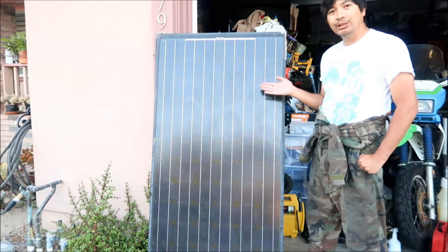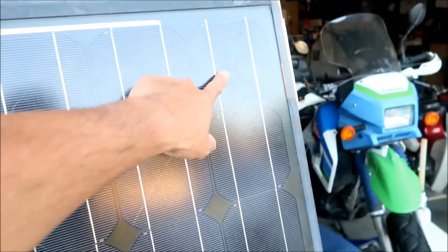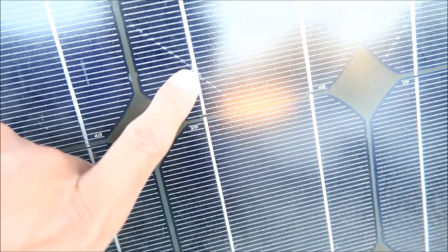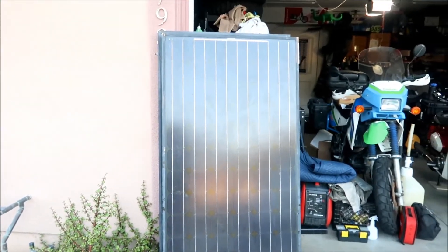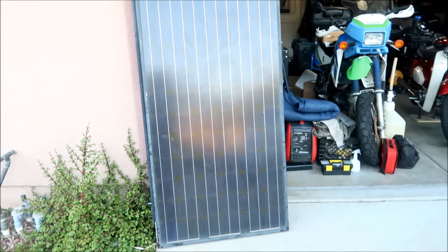Let's take a closer look. It looks like they've got six columns by twelve rows of modules. These do have what's called snail tracks or snail trails - these marks here look kind of like cracks on the solar panel. I tried to get ones without them but all of them have them, since they're 10 years old. But they all put out about 40 volts so they should still work fine. For $40 each, I can't complain.